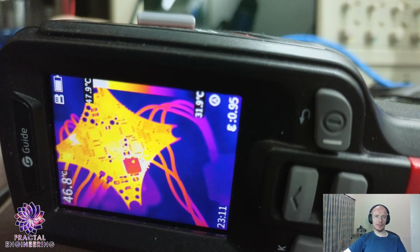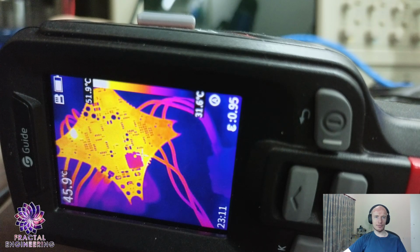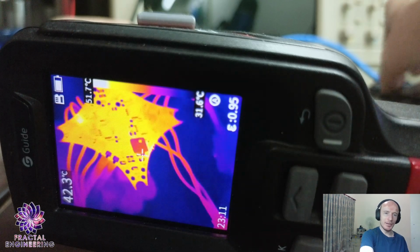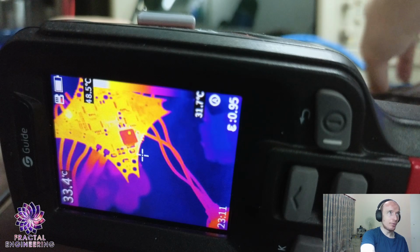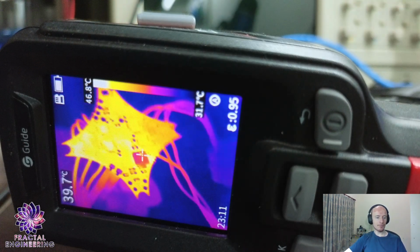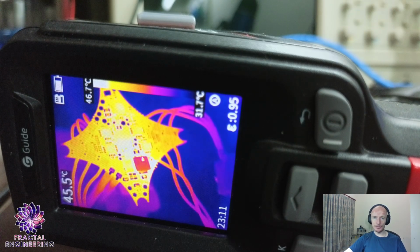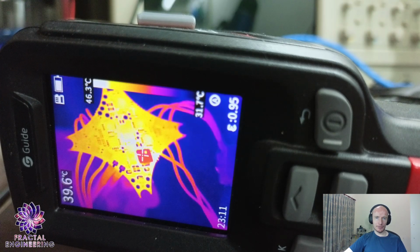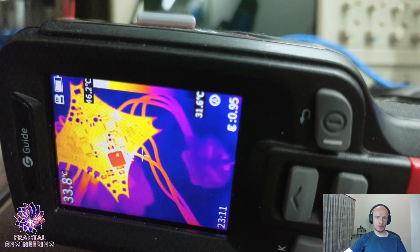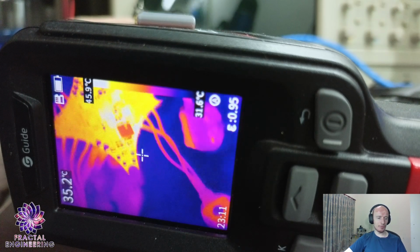That's interesting. Every now and then you can hear this one. Look at that. Oh, that might be the beacon. Okay, let me unplug the board from USB, power cycle. It always heats up on startup because of the DShot beacon. All right, now that doesn't do it anymore. Good. So doing it again. All right, motor one fixed, motor two, top right. Again, even heat distribution between all three FETs.